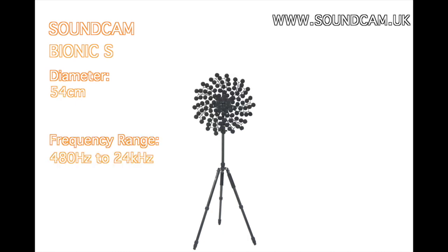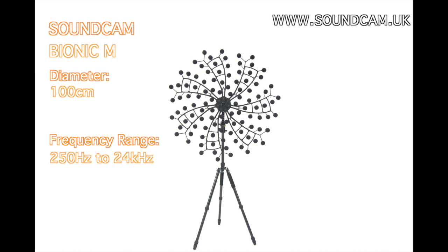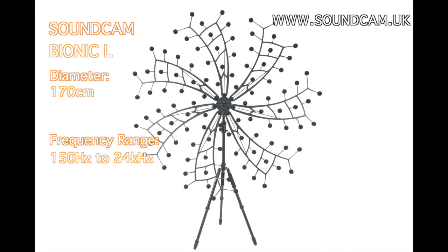The next size up, the SoundCam Bionic S array, has a diameter of 54 centimeters, and that gives it a frequency range starting from 480 Hz to 24 kHz. And then we have the Bionic M, which is the one we've been standing next to the whole time, has a diameter of 100 centimeters, 1 whole meter, bringing its lower frequency down to 250 Hz, and of course reaching 24 kHz. The L array is the largest in the family, the SoundCam Bionic L array, having a diameter of 170 centimeters, and that means its lower limit is 150 Hz, going up to 24 kHz. So that's the Bionic modular.